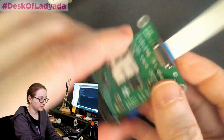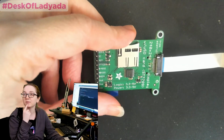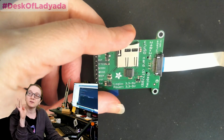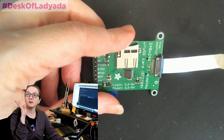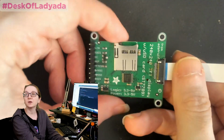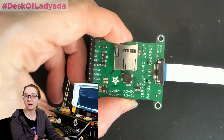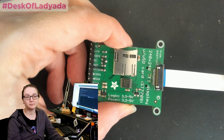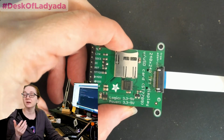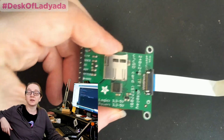And then I'm also experimenting with this. For I2C devices, we have the Stemma QT connector, right? This 4-pin, power, ground, SCL, SDA. But for SPI devices, like e-inks and screens and SD cards, I thought it could be nice to have a Stemma QT-like thing, but for SPI. And Phil and I chatted, and I said, well, should we have a cable or a flex cable, or a Pico blade cable?